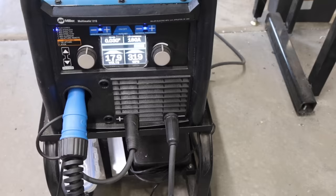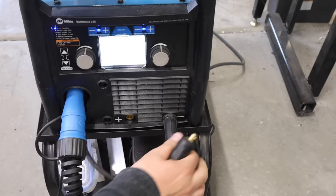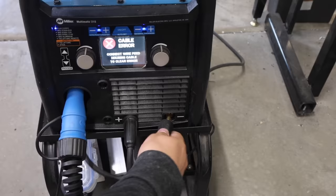There's one last thing to address with a dedicated MIG welder: polarity. Polarity refers to whether your torch or ground clamp are connected to positive or negative. With solid wire you typically want the gun connected to the positive side; with self-shielded flux core wire you usually want it on the negative side. On the front of this Miller Multi-Matic I can just switch the cables — that's a common arrangement. In some cases you may need to open the lid and switch terminals inside.